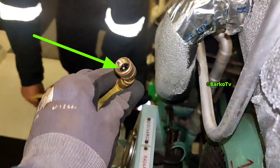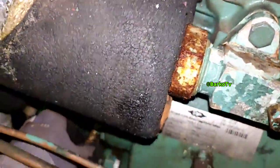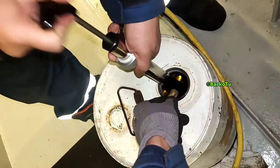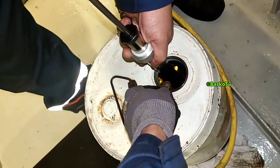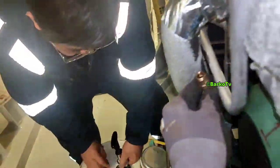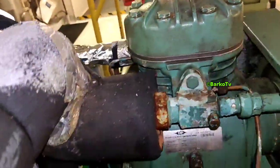As you noticed, the hose has a tip on it so that during charging it can push the check valve open, allowing the pump to charge the compressor. Before starting, just purge the air at the hose — pump it until the oil comes out — and then connect it.